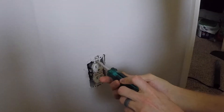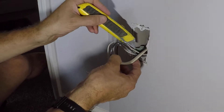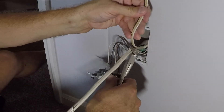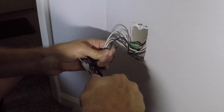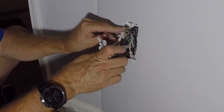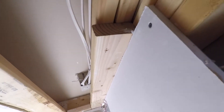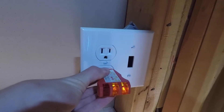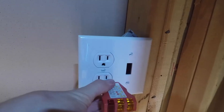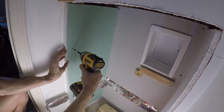There are probably a ton of other better videos on how to tie into an existing outlet on YouTube, so I'll go through it quickly. We double-check that the outlet is off after the breaker is switched off, then fish the new wire through the back hole, cut the jacketing, strip the wires, and tie them into the spots where the existing wires are. That's average granddad helping out with the electrical. After all the wires are attached, we coordinate it back into place. We now have one outlet that works and one that doesn't — which is exactly what we wanted.